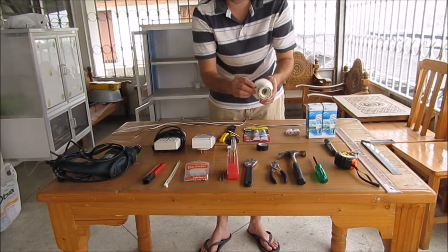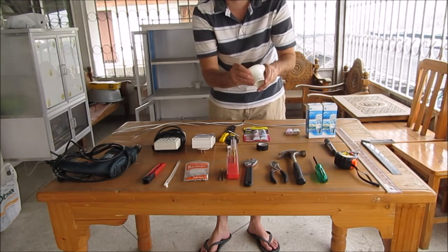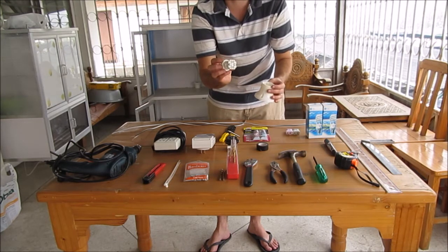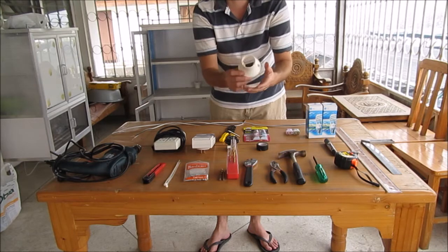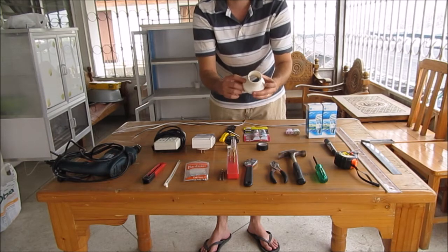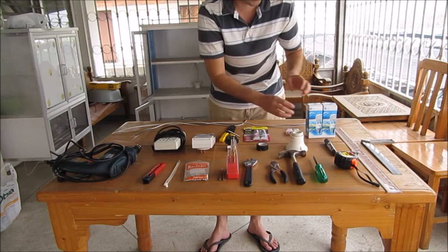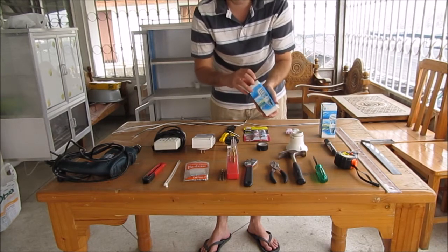What we have found to work the best are these flat outlets, which actually have removable sockets. This lets you wire the socket yourself. These are fairly inexpensive here in Thailand. It's nice because there are only two holes for drilling into your cabinet. It's quick and easy. And instead of using fluorescent tubes, we're using compact fluorescent plugs.